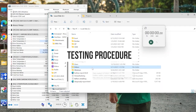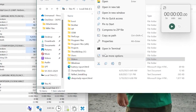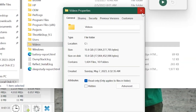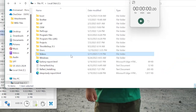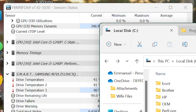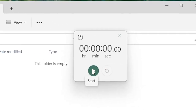To test the heatsink, I will compare the maximum temperature of the NVMe drive when transferring my 16GB video project and how long it takes to transfer the files. I will be using the HWINFO app to monitor the temperature and the built-in stopwatch to record the time.